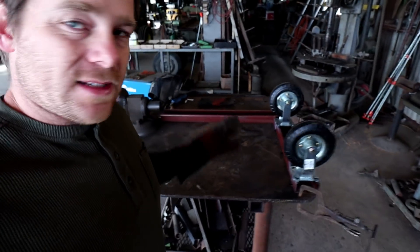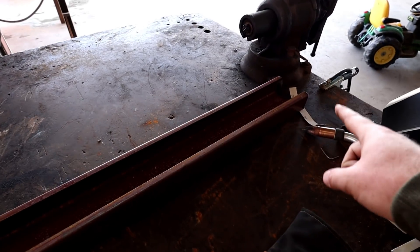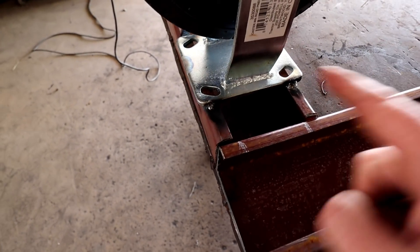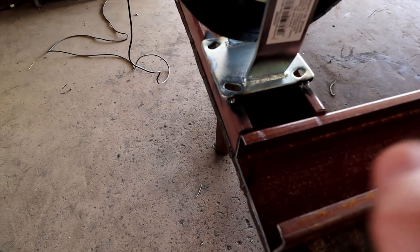Okay, so we got it welded together — I got the tires on. Obviously it's upside down, but we got this all welded together perfectly. We're going to do 36 inches from this to where it'll tie to their tractor. I'll put a little 45 in it, so it might be a hair longer than that. I marked where I want to cut out with the plasma cutter so we can continue running our wires down into the frame of the tractor, and our cutter will sit somewhere in that area. So let's get the slit cut out for the wires and then weld this together. I want to set it up next to the tractor and see how the height's going to be — do we need to drop the tongue, raise the tongue, go from there.